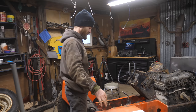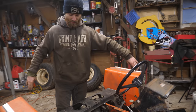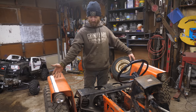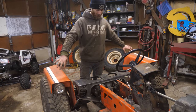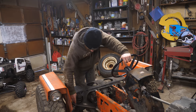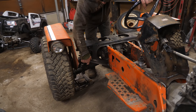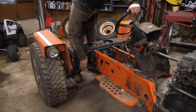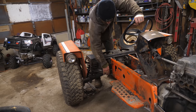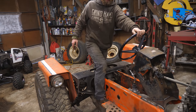The other weakness is the back end is not strong in this axis - if one tire were to have significantly more traction than the other, it'd want to twist that way. That one's really easy to fix. I'm going to add a plate that welds in all the way along this edge, up to this corner that's already reinforced, and then diagonally down somewhere in there. That will also fill in this hole of potential leg mashery.